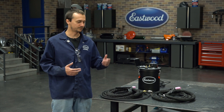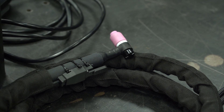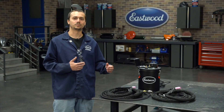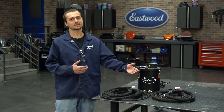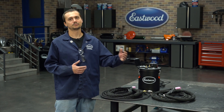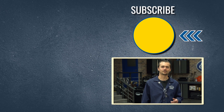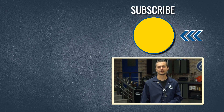On top of that, we offer two different torches. We were using the mini torch here — this is the smaller one that runs on number nine consumables; it's a WP20. If you need even more amperage and you're doing bigger projects, we also offer the WP18. That's the same size as the WP17 air-cooled torch, but you have a lot more amperage capacity and a lot more duty cycle because it's water-cooled. We're going to keep one of these permanently set up on one of our machines and be using it in real-world applications. Check out our YouTube page for more videos, and for more information about the product, visit eastwood.com.